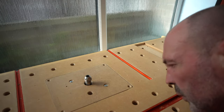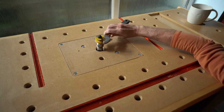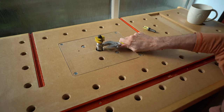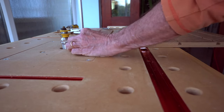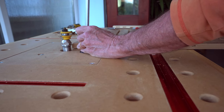Here I mounted one half of my coping cutter that I use to make cupboard doors. The shank of these cutters combined with the collet depth of the router means the base of the cutter is not high enough when I use my coping sled. But once it's in the collet extender, I have loads of height to play with.